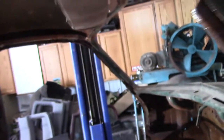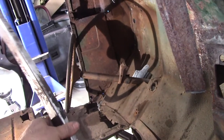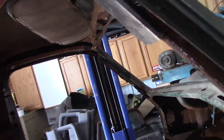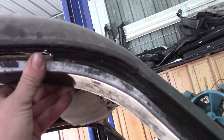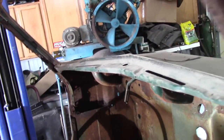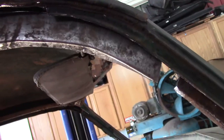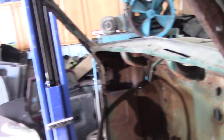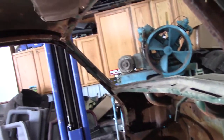I've recreated a couple pieces for that. The one piece is this piece of flat. We're using 18-gauge steel. I've got that made so it'll kind of fit right up in there. So I'm making these pieces ahead of time and fitting them as close as I can before I cut stuff out. This piece here is going to go up inside, kind of like this. It's going to be the inside piece.